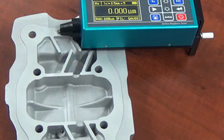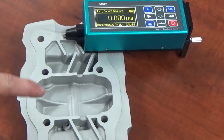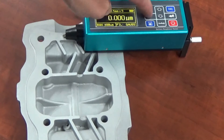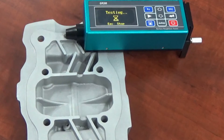It's going to show you a surface roughness number. This is on the sealing surface of this part, and it's very important that we have nice smooth surfaces for sealing. Let's go ahead and check this surface RA, and then we will go to vapor blast. Then we'll come back and check the measurement again. We're going to let it run its test here, and we'll validate that after vapor blasting.